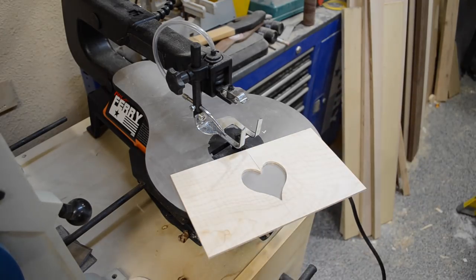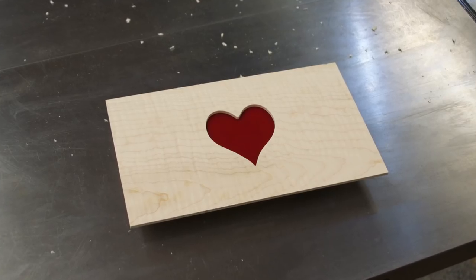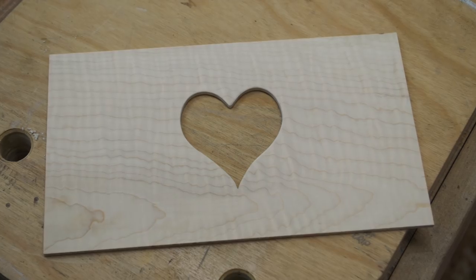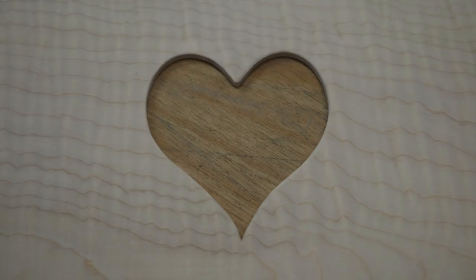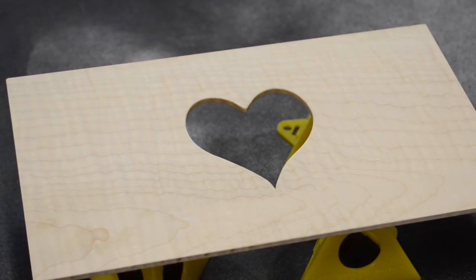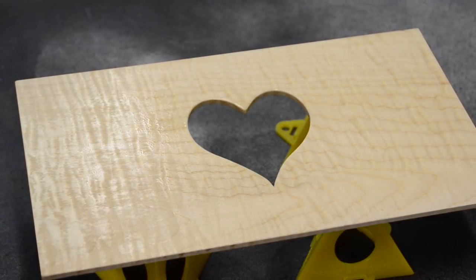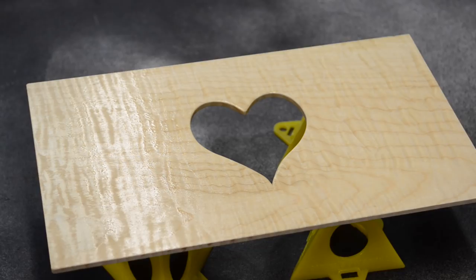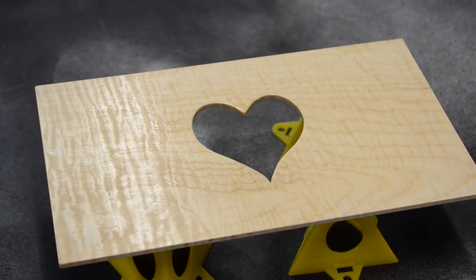Once I had the heart cut out, I set it next to the velvet — you're picking up on what that velvet is for. I used sandpaper to make sure the edges of the heart were nice and soft. I actually wanted to do an eighth-inch radius but the material was too thin for the bearing to ride on. Being I came up with this design as I went, I wasn't exactly sure how to finish it without getting finish on the velvet, so I applied some lacquer to the top of the box now to hopefully avoid spraying finish near the velvet — though I do think I have a better plan, which will have to wait for part two.